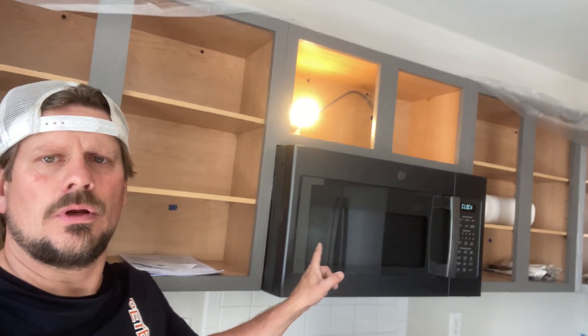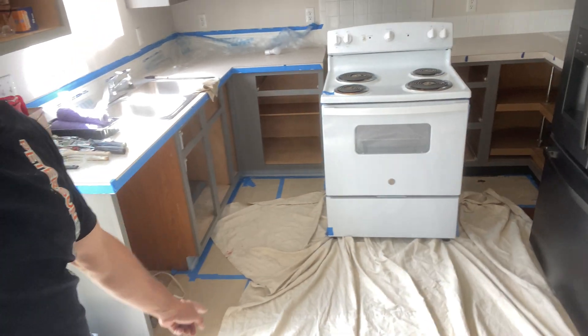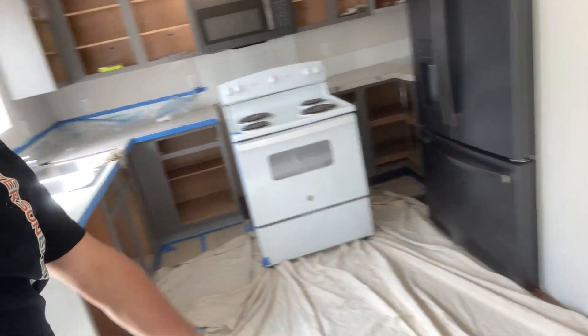The issue is putting in a brand new 1800-watt microwave and tripping all of the lighting circuit. That is a dedicated circuit needed at 20-amp, 12-gauge copper, arc-fault protected. If it's within six feet to the edge of the sink — not with the door open — you may have to GFI it, though in my opinion it might trip with the GFI. Keep in mind it has to be a dedicated circuit, so you do have to upgrade.